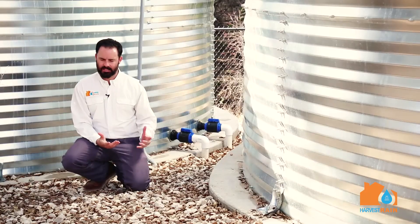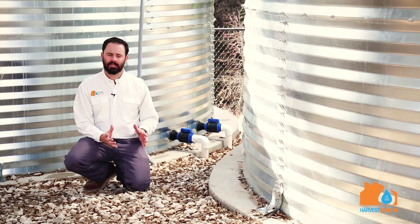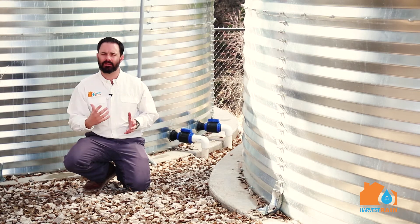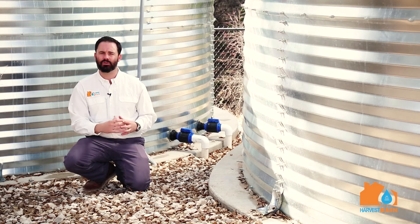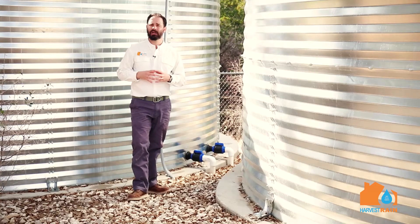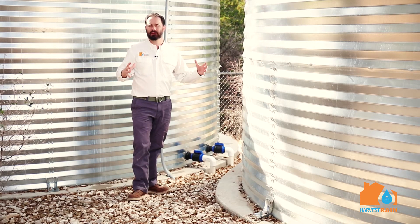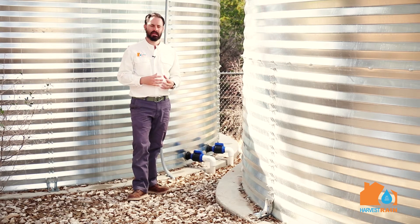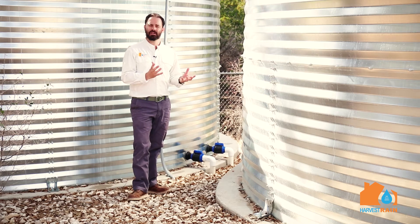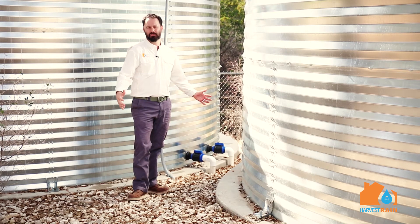These two water tanks have a combination of a solid concrete foundation ring beam — a beam around the exterior of the tank — and inside the middle we use machine sand to allow for additional drainage. We like the concrete ring beams because it gives us the best of both worlds: a concrete exterior structure to anchor the tank to, and machine sand on the inside for condensation. As condensation builds up on the tank, the water falls into the machine sand and soaks and filters through.